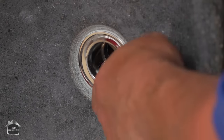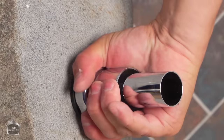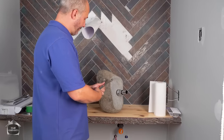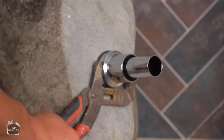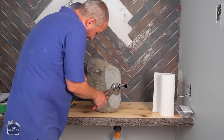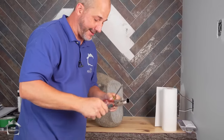I'm just going to put my screwdriver in the overflow section, which doesn't matter, okay? This sink doesn't have one. There we go. And I'm just going to tighten this up until that is nice and tight. Now, that's as strong as I can do it personally. Now, can I have my wrench, Matt? Okay. There we go. Now this is really the one chance you're gonna get to tighten this on. So, it's not a time to be shy. Now, since we're dealing with two gaskets, when you've put all your effort into that, then you know you're done.